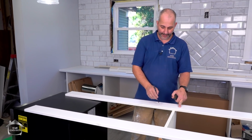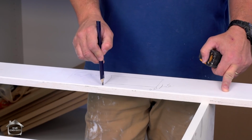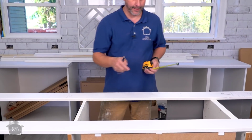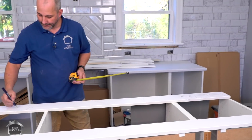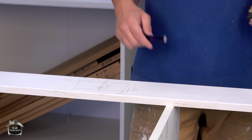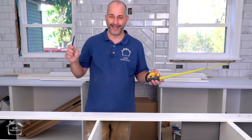Now, you can literally just take a piece of paper, say give me 105 and a half, okay, 24, 34 inches, 6 inch radius corners on the one side, all right, and now you just got to find out where your sink goes. All you do for that, you would mark the center line right there, measure over here, add your 1.5 inches. You can take that number now and go 37 and a half. Nice and simple, right? And then if you want to, you can fax them the template or you can drop it off, or a lot of countertop guys like to come out and measure themselves, right? It's a great big waste of time, but having that template when they manufacture is the key to success.